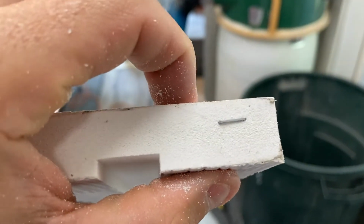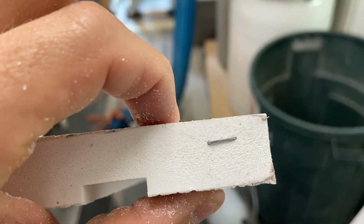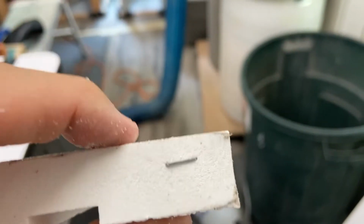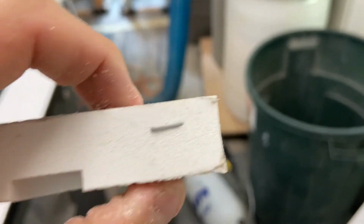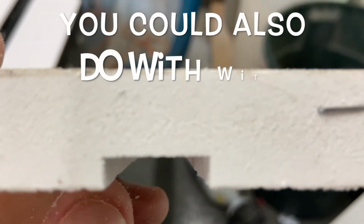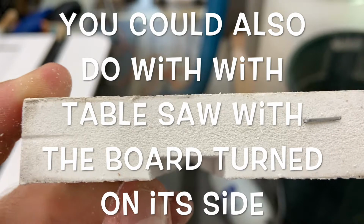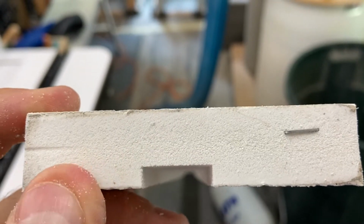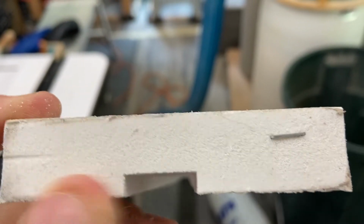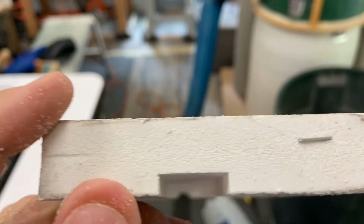The gap in the window, the nailing fin, the flange, the J channel, as you might call it, is 3/4 of an inch wide, so this fits kind of tight. What I'm doing is routing out maybe not quite 1/4 of an inch, and I'm going to carry this all the way across. This will sit flat against the sheathing, and the window flange will sit up under here.